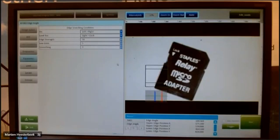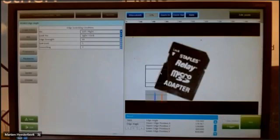You can make it bigger or lower. In this case, if you make it 60, for example, then the green line will go up. So if you have some distortion in your object, then you can play with these items. And also smoothing, now it's 3. That means you have a very wide one. But if you go back to 1, for example, then you see the smaller items also. But that is difficult. This is not what you want to see, so you can better make it a little bit smoother. And then you have only one peak.